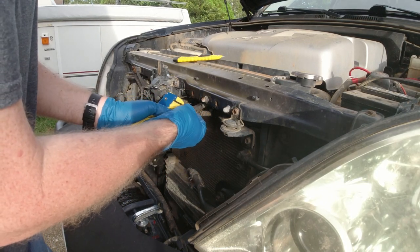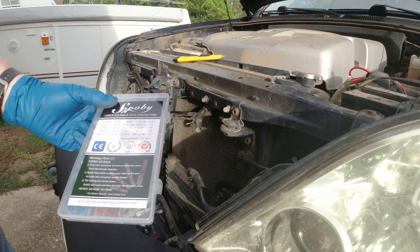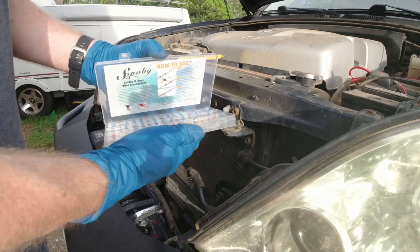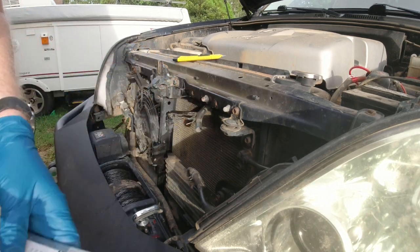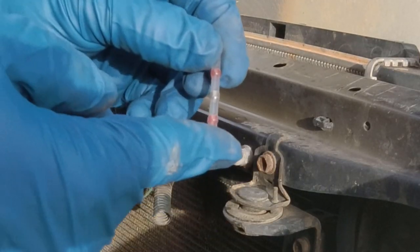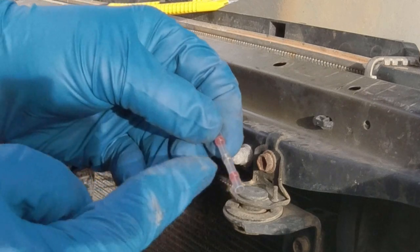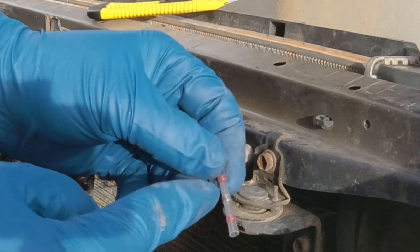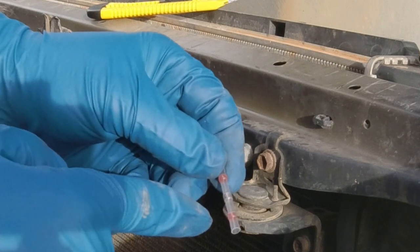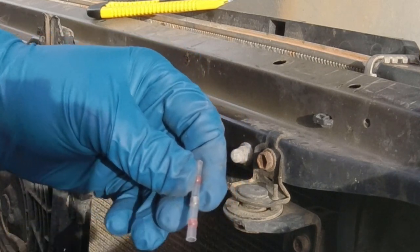I'm going to be using the solder and seal connectors he provided. The interesting thing about them is they don't require any crimping and don't require a soldering iron. These are the red type — good for weather sealing — and replace a regular red crimping-style connector. There's a little bit of solder in the middle. You'll want to twist your wires together and make sure the wire is joined here in the very middle. As you heat it, the low temp solder will melt and join the wires together, and the heat-shrinking tube will seal up and give you a nice weather-tight seal.